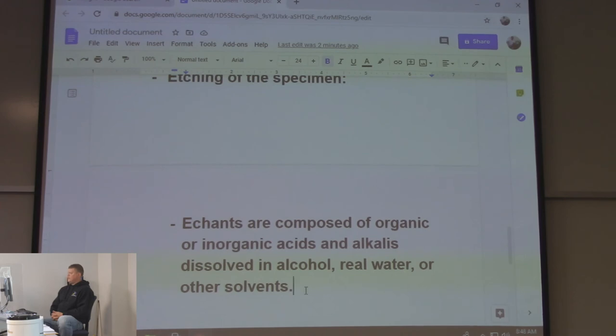Real water. They say that the TIG welders out there are water cooled, and they always said distilled water on it. And I said, stick that hose in there. I stuck a hose in it, and as soon as I struck an arc, it shocked me. I was like, oh, that's why they say distilled water, right? Because water out of the faucet conducts electricity, because it's all full of that nastiness. But turns out you really have to use distilled water if you're putting water in a water cooled welder. I don't know. Not a real bad shock, but it lets you know you're alive.